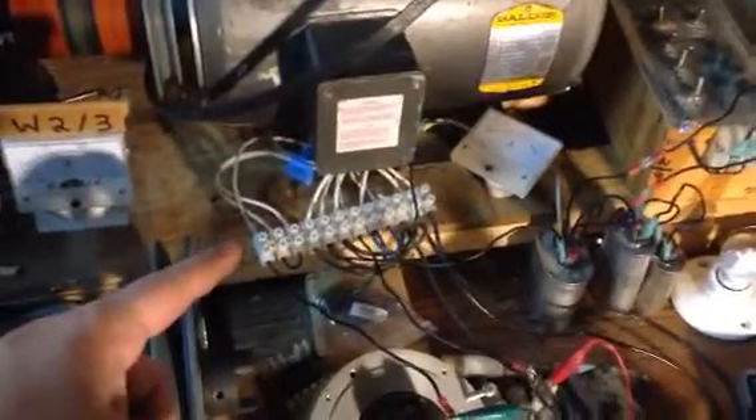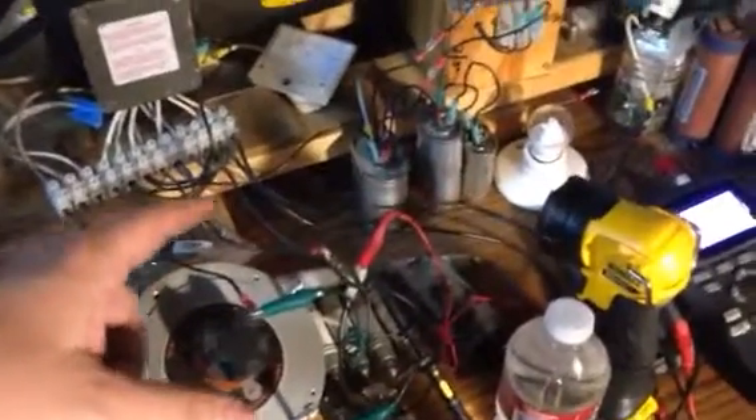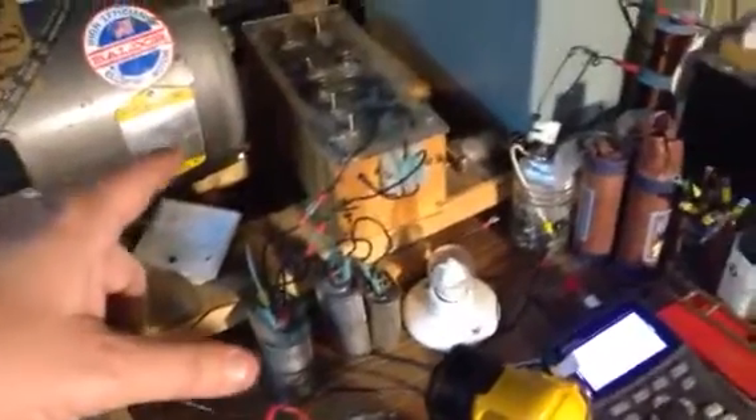All right, so this is a video of the setup. The RV alternator is here. I pulled the center Y out, so we have a 10, 11, and 12. It's wired up right now so that 6 and 12 are both open ends, and they have in common 9 and 3, which are connected as this lead here. So right now the scope is across 9 and 3.